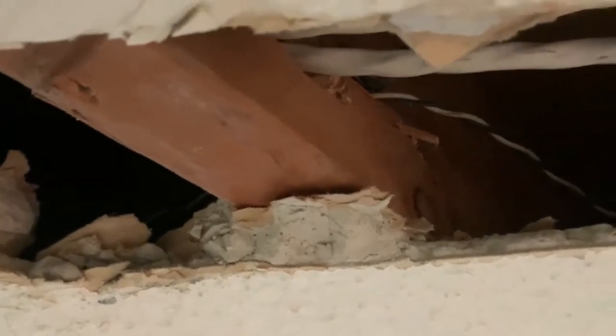Now, this is what I've seen. The ceiling drywall is directly attached to the joist, so there's no space for you to drag the electrical cable across the flooring or floor railing or joist without opening the ceiling and drilling against the joist to insert the cable across. However, you can freely drag the cable if the direction is parallel to it.